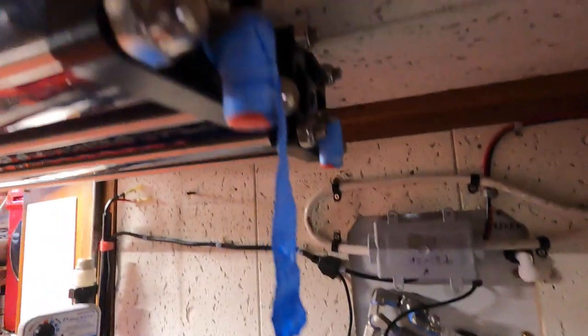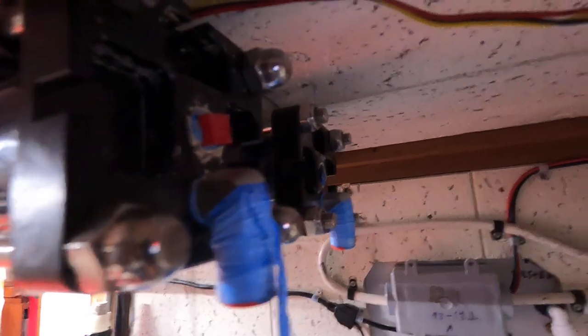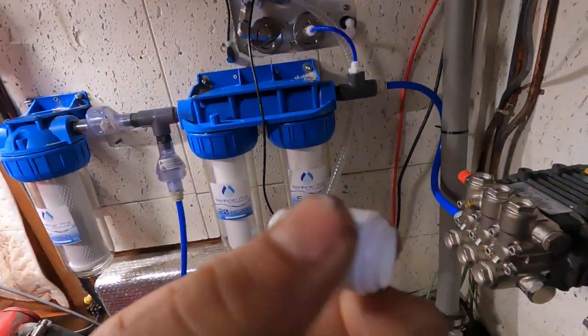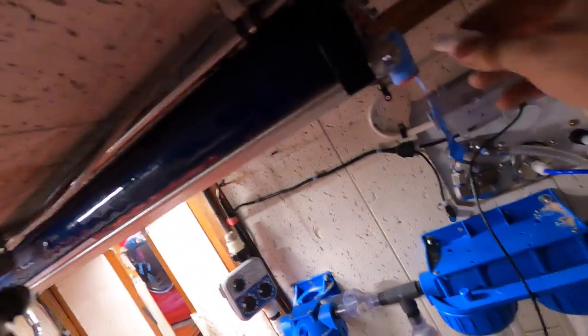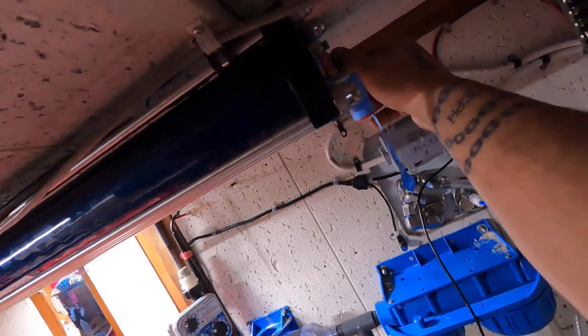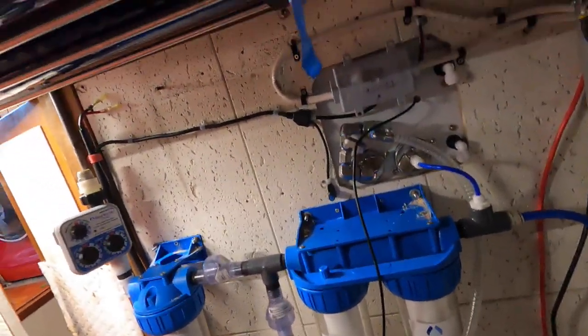So it's gonna come in, salt water go around, and then this red plug stays in on this side, but the rest of the red plugs have to come off. And you're gonna put one of these compression push-in style fittings in. So you're just gonna thread it in. All right, so get that fitting in.